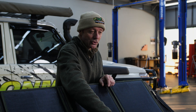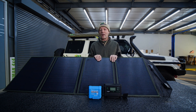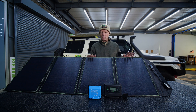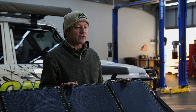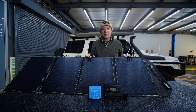So, should you spend the money or not? Let's have a quick look at the specifications. This here is an Ironman 4x4 120 watt panel running at 18 volts internally. When you connect it to a PWM controller, you take the wattage of the panel — 120 — and divide it by the voltage of the panel, which is 18, and you get around six and a half amps. So that is the amount of amperage you're going to be able to put into your battery, given you don't have any losses with cable length and such. Six and a half amps — that's pretty good.